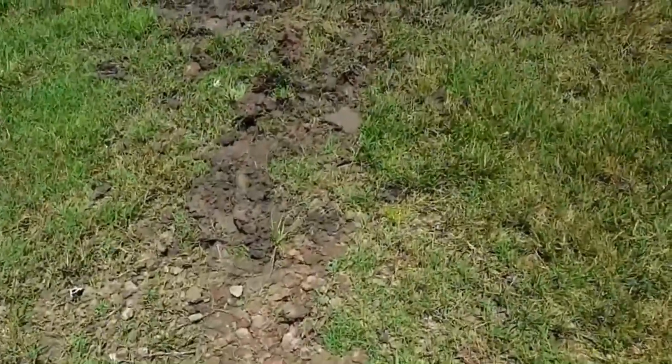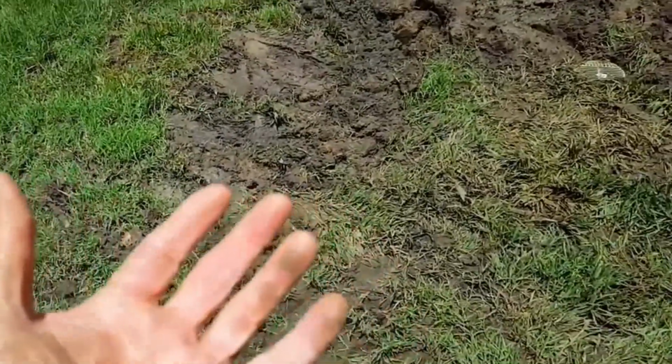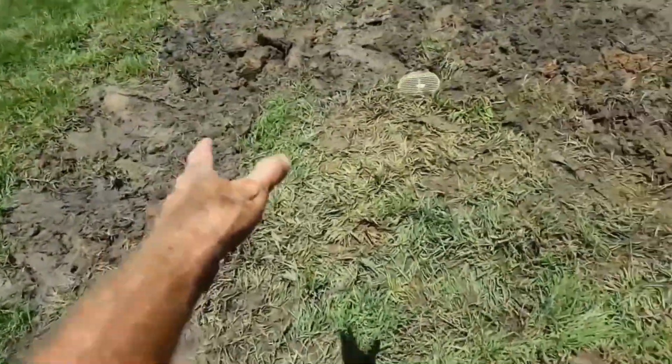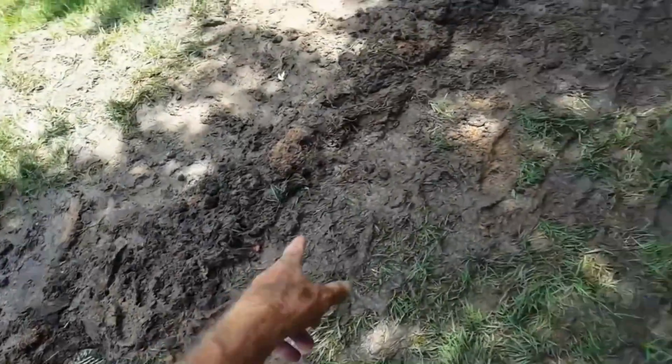So right here, as we tied into the existing line, we have a small section of solid pipe that runs to our first catch basin. That section of solid is only about 6 or 8 feet, and then it turns and starts into our new system. So we've got solid pipe coming around, French drain. We used the easy flow, added catch basins, French drain between the catch basins.